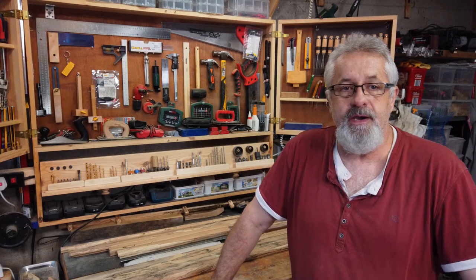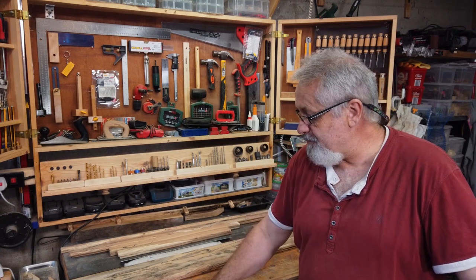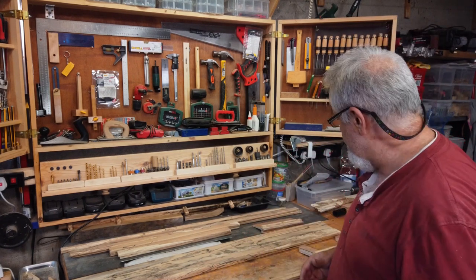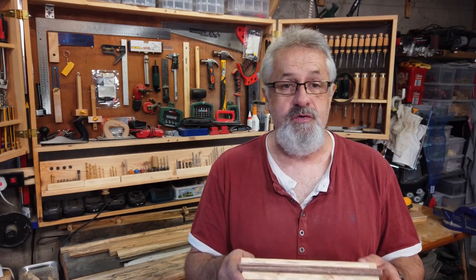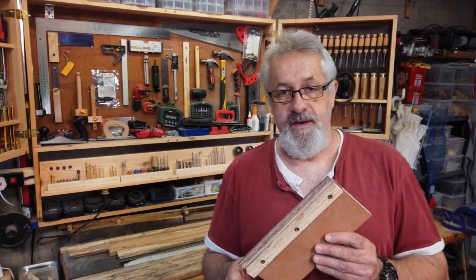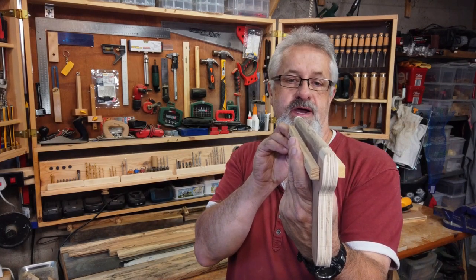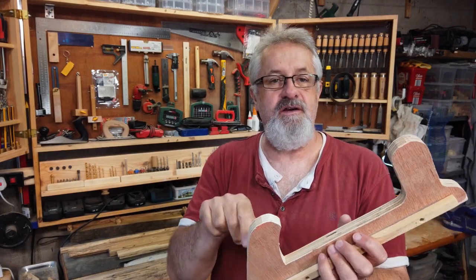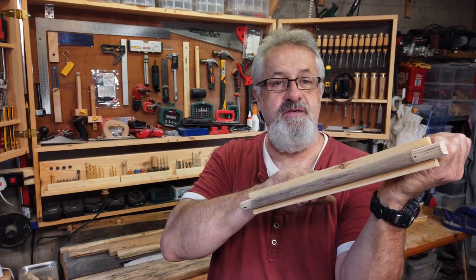Now earlier on I spoke about using jigs and anything to help you through your process. Now I've kept two pieces that I still need to sand just to show you one of my jigs or an example of a jig. With the previous batch of slimline pen cases, I used this to sand the grooves. And now with the bigger groove, I had to remake this jig. Now let me show you. And there's your 18 mil diameter. A little bit easier to sand. Now the routering I'll do a bit later on, but this is the jig and let me show you how I use it.